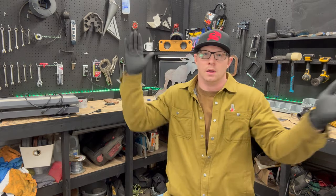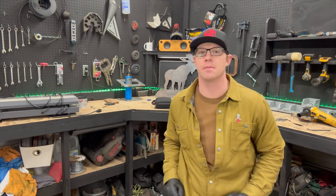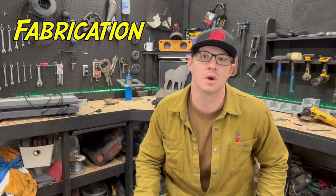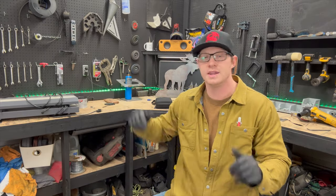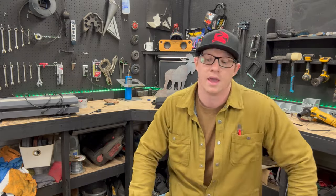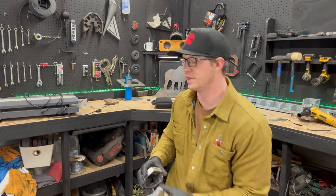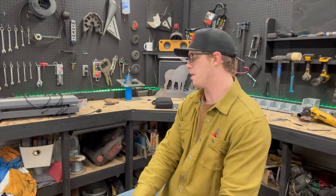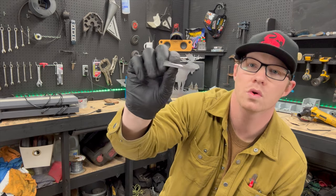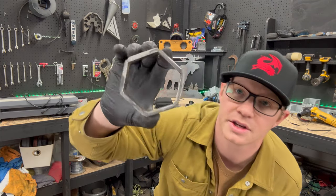Testing, testing, one two three. What's going on guys? This is going to be the first installment of what I'm calling Flogs — fabrication logs — where I'm going to take you through each of the tasks I need to do on the projects I'm working on and show you everything in a raw state. So today we're going to be making these little hex features out of one-inch flat bar pieces that are a quarter inch thick, that I'm going to cut up to the correct angles on the ends to make a hex shape just like this.